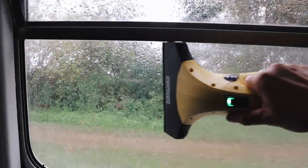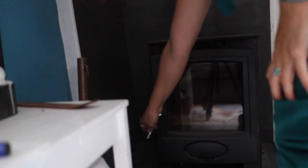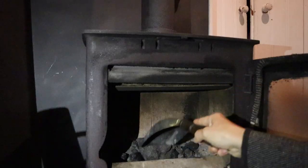There are a few reasons why you want to do that, not only for warmth. First: condensation is a challenge on boats, and by having the wood burning stove going for long periods of time it really helps to keep the place dry. Another reason is economy — starting it every time and adding a log every time isn't the most economical way. Also, once the fire goes out and the temperature drops, everything on the boat cools down, and it takes a lot longer to warm the boat back up from cold.